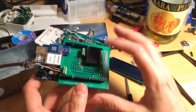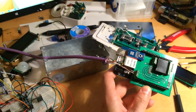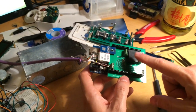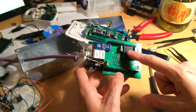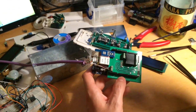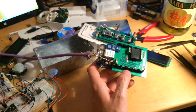This thing here is a buck converter, which will convert down from my 20 volt power supply coming through the Cat6 cable from the Dell charger that I'm using, or 19.5 volts. It supplies a wonderful 6 amps plugged into an 8-way kind of patch. What am I trying to say? It's a power injector. It's an 8-way power injector. You plug one Dell charger into it, and it will provide 8 of these things with enough power. I think this thing is only using about 500 milliamps in total.